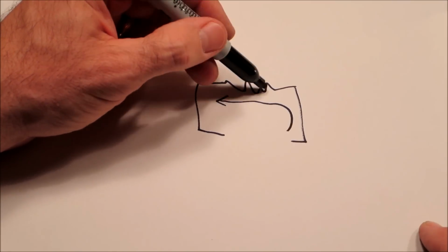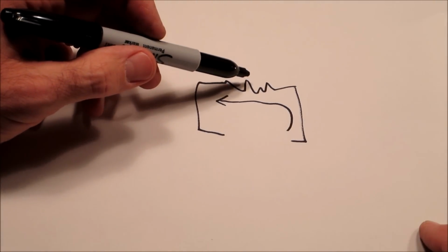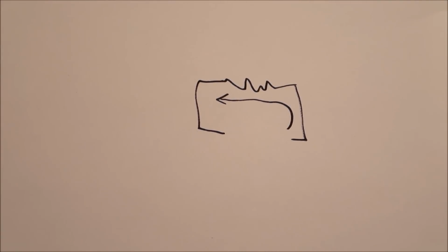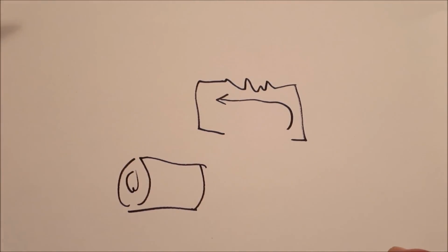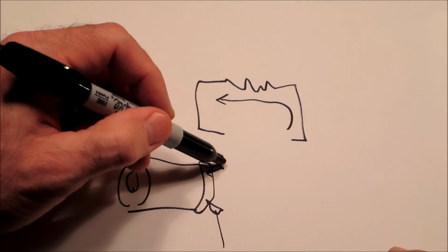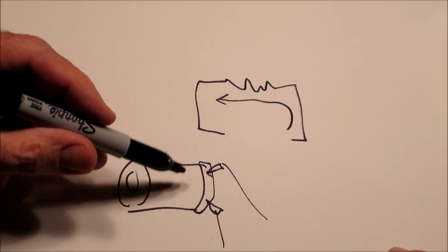Depending on what's making up that resistance, it could be a light bulb that would turn on. It could be a coil, which energizes. Hopefully the theory about electromagnetism is something that you've all seen, where you could, for instance, take a nail and wrap a piece of wire around it and then hook it to a battery, and the nail becomes an electromagnet. Well, a coil is very similar on a pinball machine. It's just a big coil of wire with a hole in the middle. It looks something like this. It's a bunch of very small wire spun around, and it's going to have two leads hanging off. If you hook electricity to these two leads, like if this right here was a coil, when you apply electricity to that coil of wire, it creates a magnetic field.